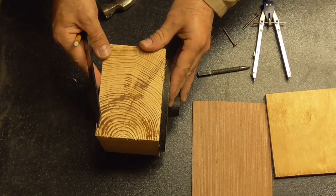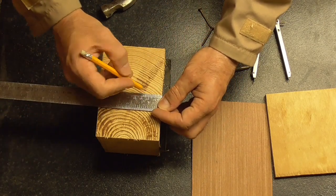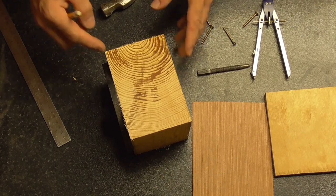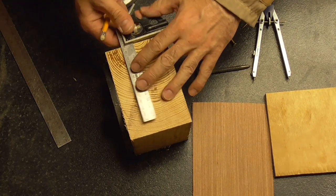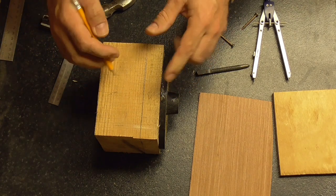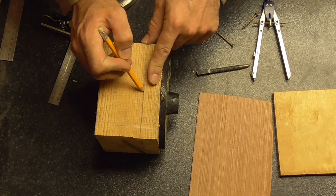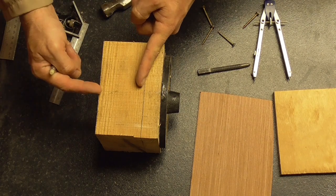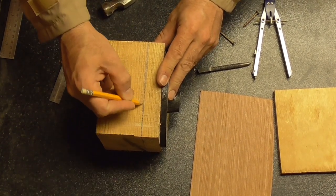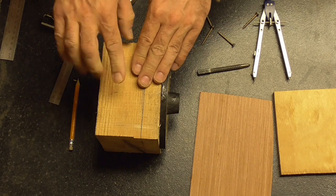Turn our jig to the side. What we're going to do is measure from the edge of our stock — not from the face plate — 25 millimeters in or one inch. So we have a line 25 mil or one inch in. Even though it's a few millimeters further in than our screw is actually going, it gives us a reference of how much we can bore out from this blank without hitting the screws — that always protects your screws. Next step is we're going to put this on the lathe and turn it round.